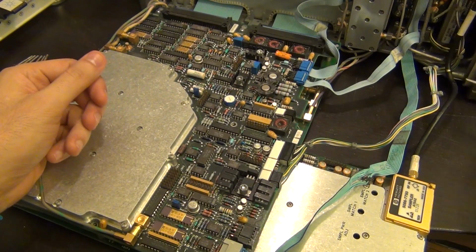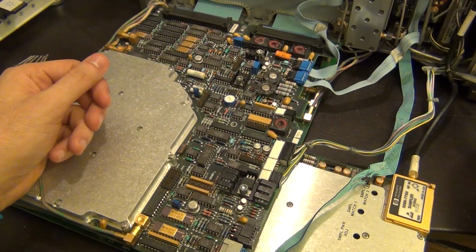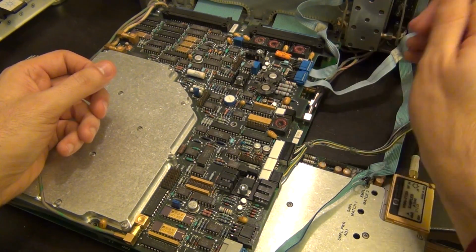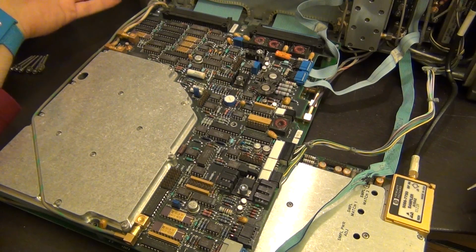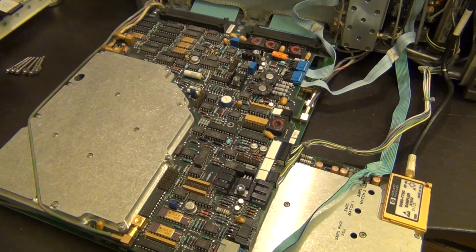I also see that the cables are cracked. You can see, for example, all the way up here, the plastic has cracked. That's just due to aging. Again, here I have another cable that is cracked. These cables here in the corner, if I bend them, the plastic actually breaks apart because it's so old due to thermal effects over a long time. They've dried out, they've heated up, and are now very, very easy to break.